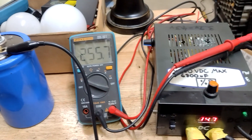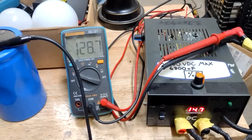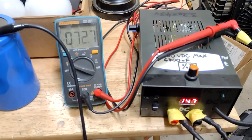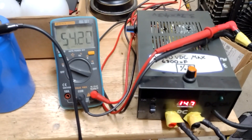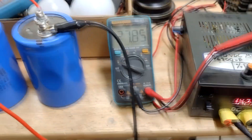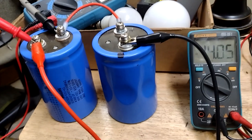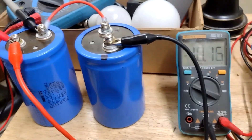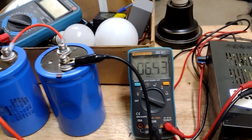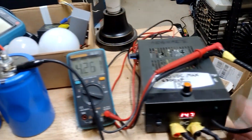You can see how the bleeders work — it's kind of an inverse of the charging. It's going to bleed off that high voltage really quickly, and as it ramps down it bleeds a lot slower because the voltage is getting lower and lower. Once you're right about there at a safe level, that pretty much concludes a basic test — just double-checking to make sure these caps are going to hold up fine under voltage, and without having to mess around with any line voltage in the process.